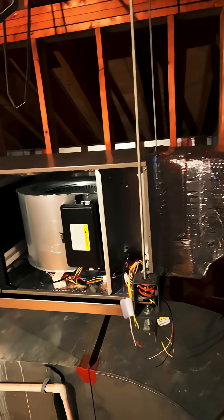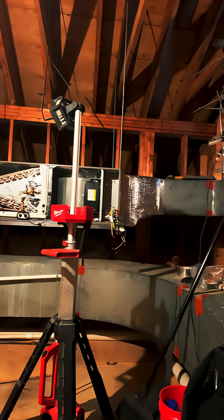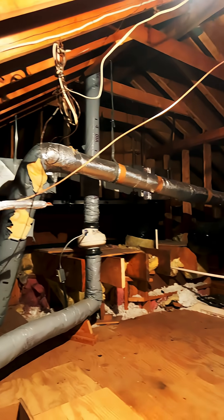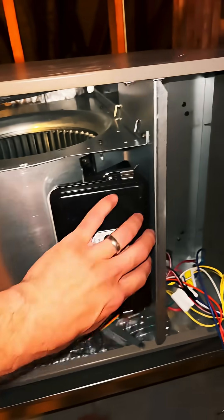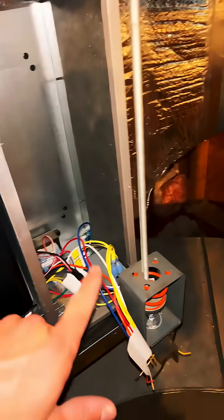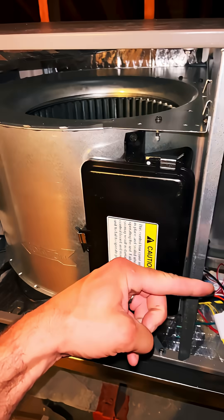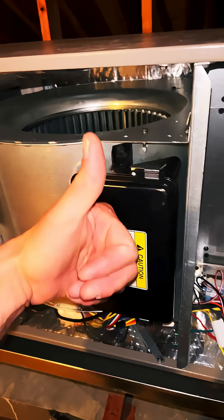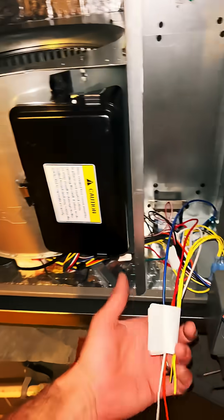More adapters, new pans. He made me some nice two-inch filter boxes. Here's the sniffer for your new R454B. Here's the hub box that everything comes into and then goes out of — so if there's a leak and it senses one, it will kill power to the outdoor condensing unit, shut that down, turn the fan on full speed, and open up any dampers if need be.